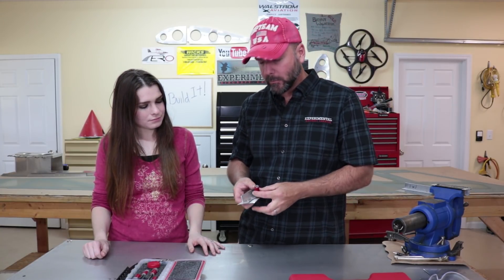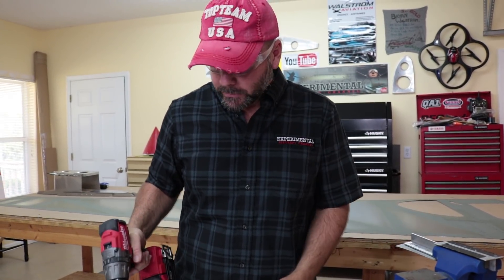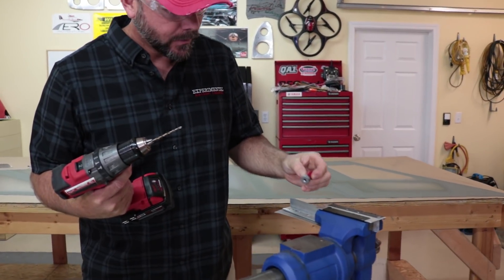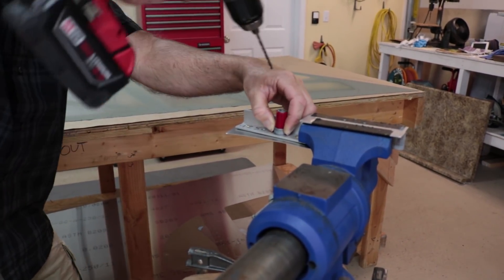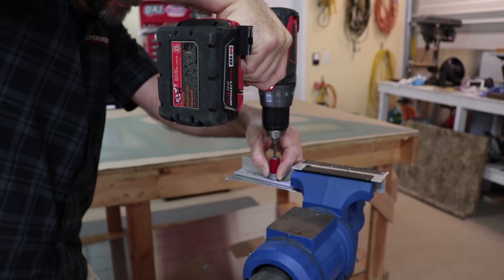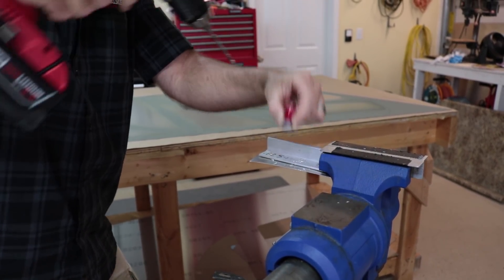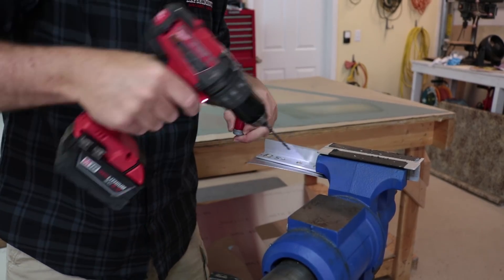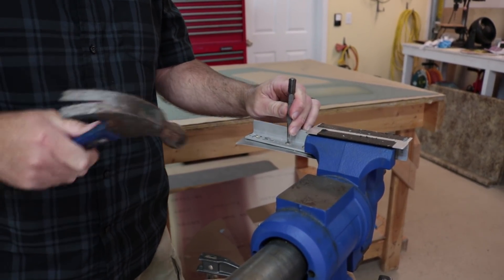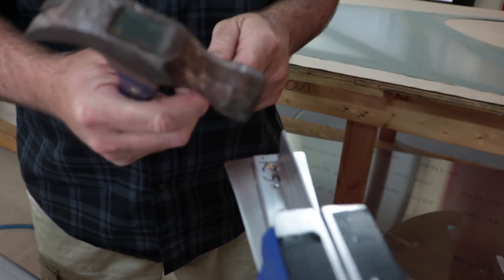They supply some drilling oil with the kit — just dip your drill bit in there. You've got your guide and you place it over the rivet you want to drill out, hold it nice and flush, insert the drill bit, and drill just a little bit. Clean out the burrs and check to see how deep you've gone. Then you take a punch and a hammer, give a couple of taps — or even just one tap — and it pops right out.